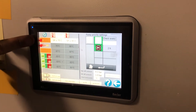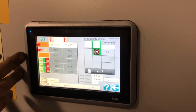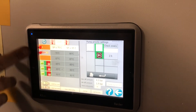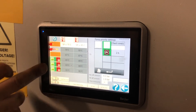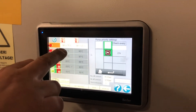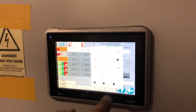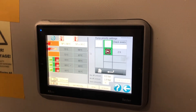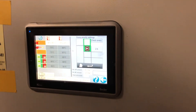So the heater or the burner will burn up to 75 degrees — there it will stop. When the temperature drops to 70, it will start to burn. If the temperature keeps dropping down, heating element number one will come on at 65 degrees, and the others at 63 and 61. If you change the set point here — let's say to 80 — then all of the other values will also change. So you have the same limits: 80 degrees minus 5 degrees, so this will always stay the same.